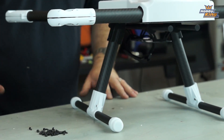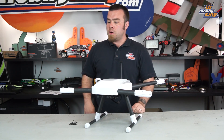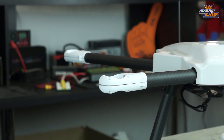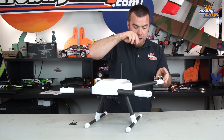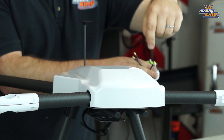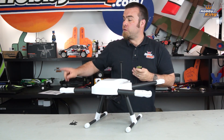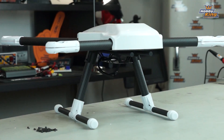I'm going to get the motors together and get everything put on. I've got a little bit of soldering to do because of the length of these rear arms — as I said, the wires go down the inside of the arm. You can see they end about halfway down the arm, and the ESC doesn't quite fit in this tube, so I'll mount the ESC in the frame just short of the arm, which means I need to extend these back two sets of motor leads. I'll solder an end on my NAZA so I've got everything I need for power.